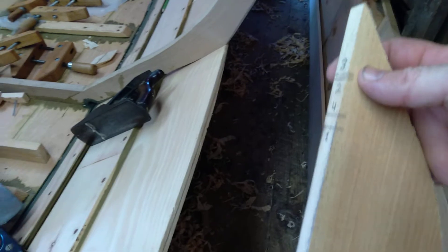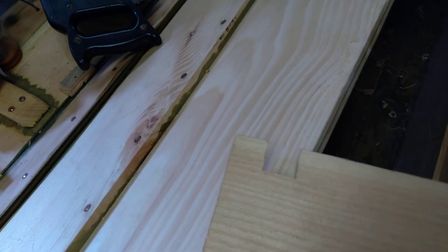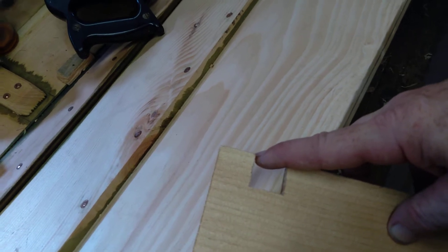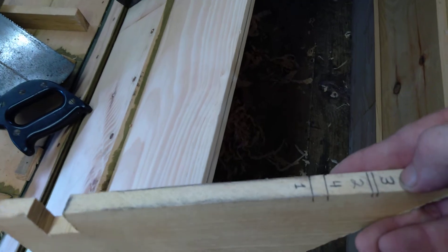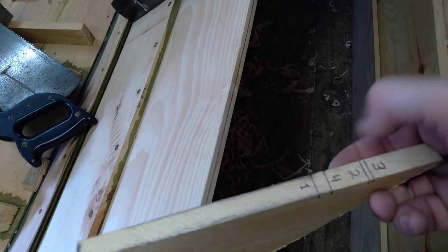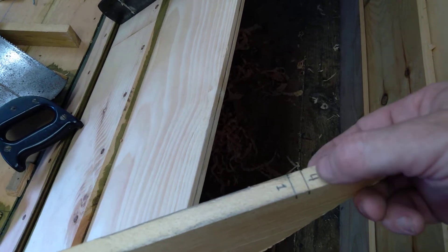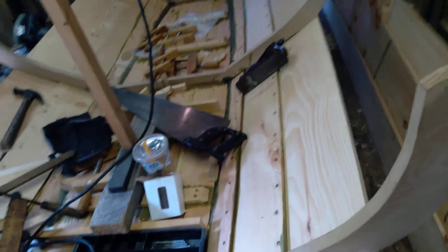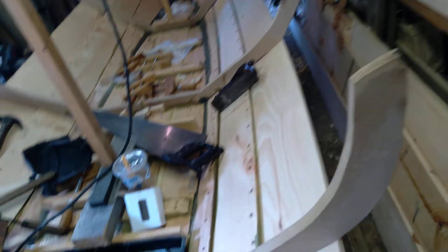What I did is — the only important part of this jig is a straight front face, and then the length from this bottom edge, which represents the bottom edge of the plank I'm going to be putting on — that registers that dimension. And then these tick marks: the difference between that angle and these tick marks is the width of the plank I'm going to be putting on at each of the frames. So here's the width at frame one, frame two, frame three, and frame four. You can do pretty much the same thing with a steel ruler and have a very similar result.